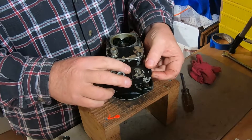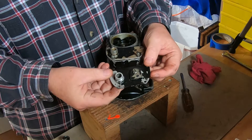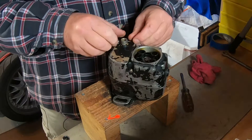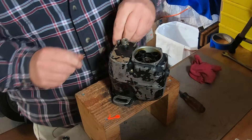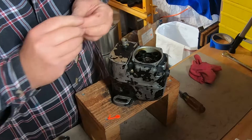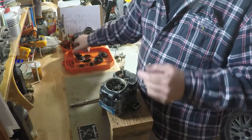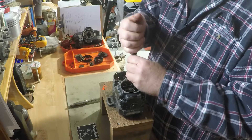Here's one with the round style that has a little hood on it. Now we'll continue removing the screws, checking the condition of pretty much everything as we disassemble it. I'm looking at the screws right now — these screws have been rounded out pretty well, they'll get all new hardware. Looking at the inside of the breaker compartment: there's oil in there. Oil is not supposed to be in there — it's supposed to be in the back of the engine. That tells me the forward seal has probably been compromised.